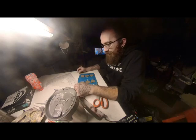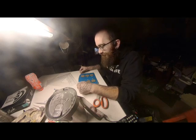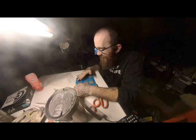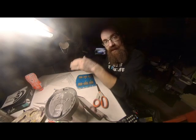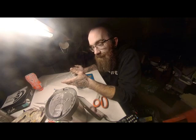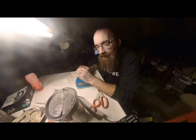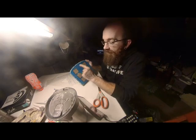Now, the tricky part is when you get to the more extreme concaves, like the wide, the platypus, stuff like that, you're going to start having problems with pinch corners, which is pretty much where the plastic of the gasket meets the highest lip of the concave of the pad. And because the pad is concave and the gasket wants to remain flat, you get that small little triangle in the corner where you can start having issues, where sometimes in extreme cold weather, the kush material will contract a little bit, and that will cause it to pull on the gasket and then create a little bit of extra pressure. So in order to circumvent that, all you need to do is add four corner pieces.